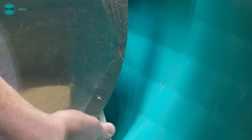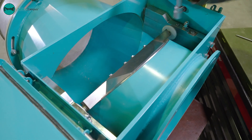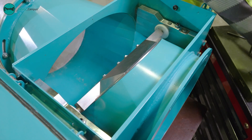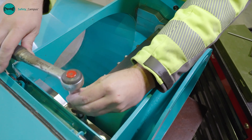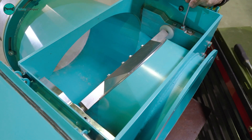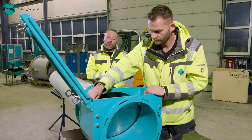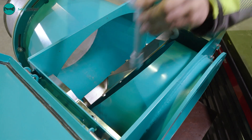Once the measurement is completed, we release the valve blade, take a ratchet and loosen the cap nuts on the locking mechanism — the dust protection. We then slightly loosen the locking nuts on the locking mechanism, take an allen key and loosen the lock. By loosening the bolts on both sides, we release the valve blade and it springs back into its starting position, into the opened position.